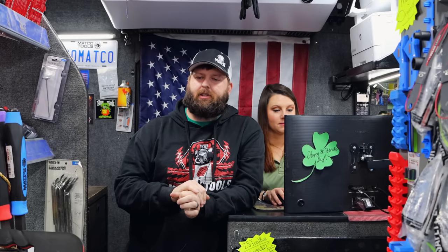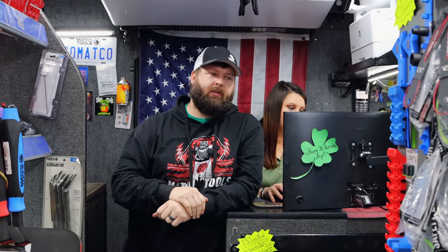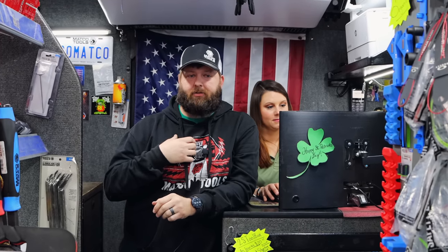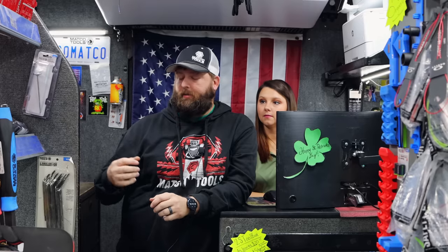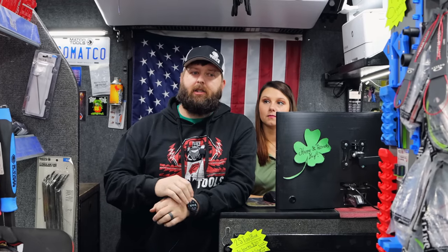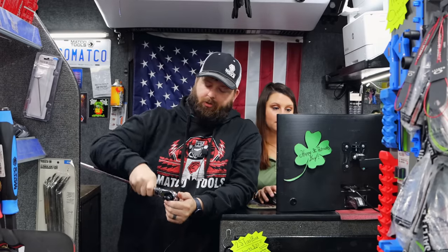The number one thing not to clean your tools with is brake cleaner. And there's a reason for that. I know everybody that has done it, like myself, is probably thinking, you're crazy. It works quick. Spray it on there, wipe it off, it's dried, everything's good. On the ratchets, it actually seeps past that plate that you saw me put on last, and then it comes out the other side. So what comes out of the switch hole.